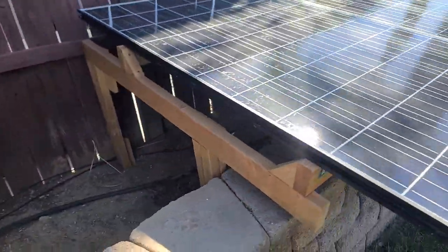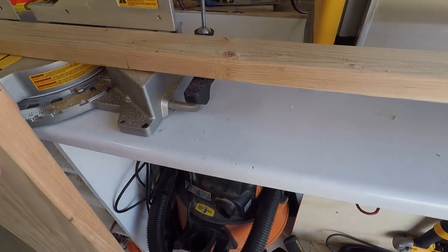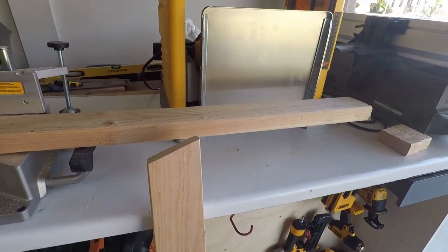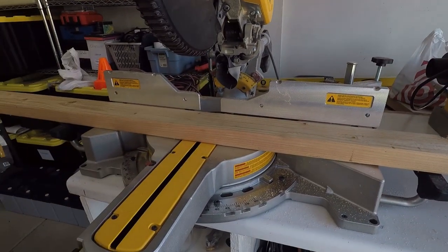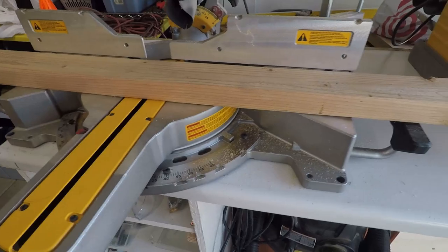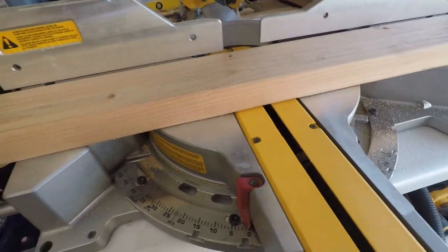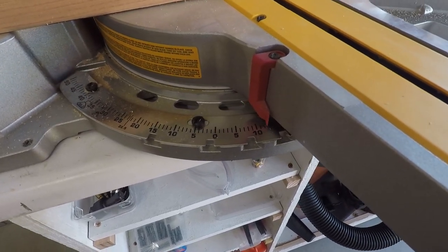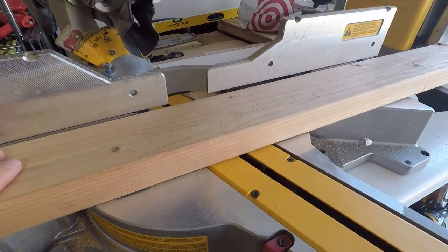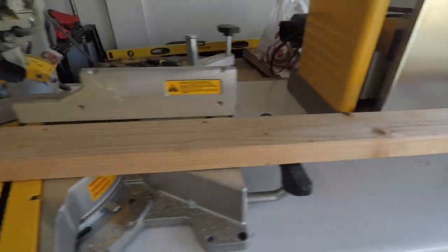I'm working on the legs that will mount my solar panels — this is the structure the panels will be mounted on. The one I'm building will be set for a 20-degree angle to maximize both winter and summer solar capture from my location. Depending on your location, you may want a different angle. One leg is 48 inches with a 20-degree cut. I'll go to 20 degrees, go a little past my 48-inch length, make my angled cut, and then a straight cut on the other end.